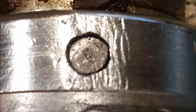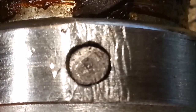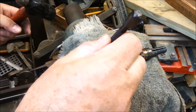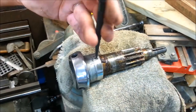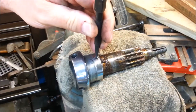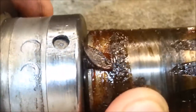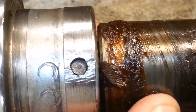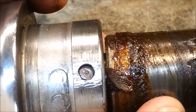I made a really gentle center punch mark to see if I could hit the middle of that — I think I'm pretty close. Maybe I can strike it a little harder. This is my John Fisher February 22nd, 1969 ball peen hammer. There we go — found that center punch mark. See, that drove that end further. It's tempting to drive it all the way in, but then it might get a lot harder to get out. So now I'm going to drill it.